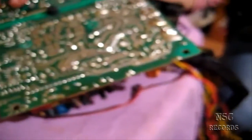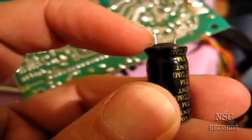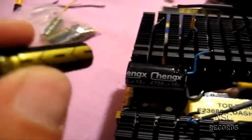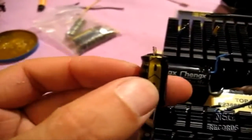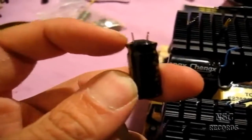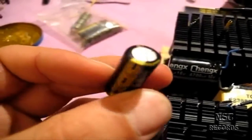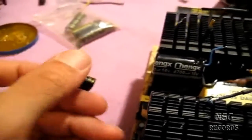You can see this part here - it's going up like a small hill. You can see they are broken. And here in part two, there is also a small hill going up. That's how you identify broken capacitors - they bulge upward like that. And here you can also see the brown residue again - definite signs of failure.